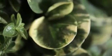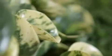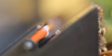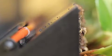To make sure your living wall survives, proper irrigation and maintenance is critical. To figure out the irrigation, start by setting the amount of time the water will be on. Turn on the valve and start the timer to see how long it takes for the water to start dripping out the bottom of the lowest panel. This is the amount of time at each interval.